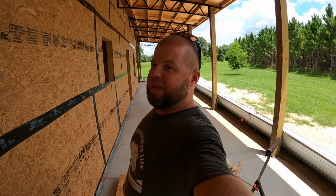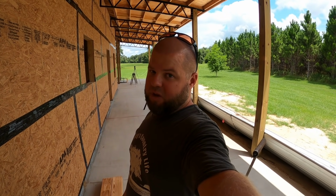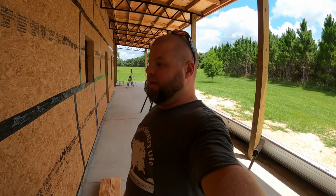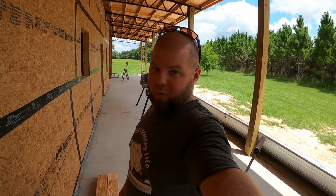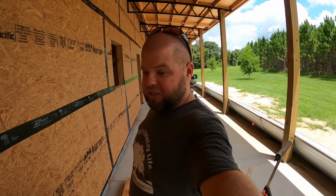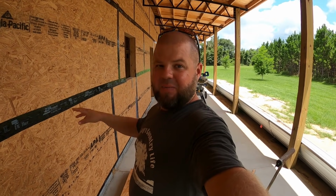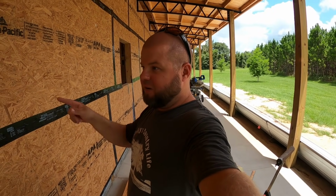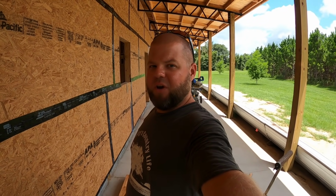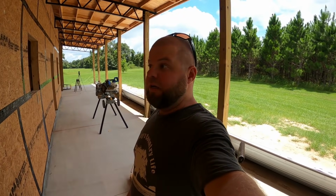I'll tell you what's another good thing that I did. I found like four locations where I missed nails. Getting hot, running down to the fan, taking a lunch break, taking a water break, answering a phone call, you wind up forgetting, hey, I forgot to nail this section. I found several today. That's the beautiful thing about putting the tape up too. If I had just thrown house wrap up on it, there were several sections that were not nailed that I would have completely missed and would never have known about until they're blowing around, creaking, flopping, something like that.